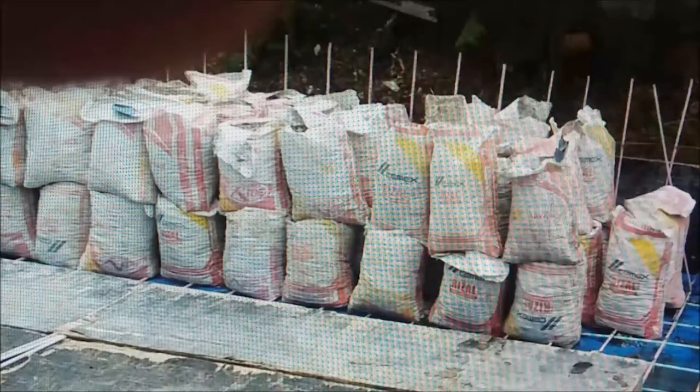You can see the vertical bars are much neater now with just that one piece running across them. It's rainy season, so when it rains they go up to one of the five lanais around that level of the house. A crew of six poured this floor — we usually have 10, but six people did this one. They show bags stacked at the top — we take our bags at the end of a pour and put 19 into one so only the outside bag is exposed to UV. When you're working really steady the bags are always full of gravel and you can't hide them from UV, so the bags deteriorate.